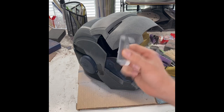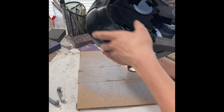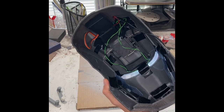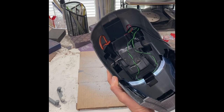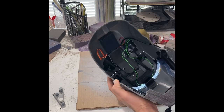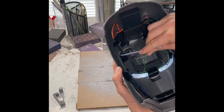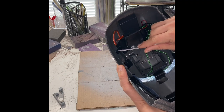So I was playing around with motorizing this without the hinges and stumbled upon something pretty amazing. I'll open this helmet up from the inside and show you. Everything is just taped together at the moment, but I wanted to share exactly what we're talking about. Instead of those nicely engineered helmet hinges, we are using some quarter-inch elastic - plain, simple, and stupid. We've got a piece of elastic on either side, with one section attached to the top of the faceplate.